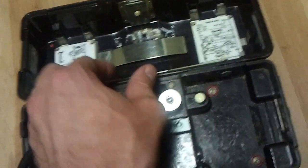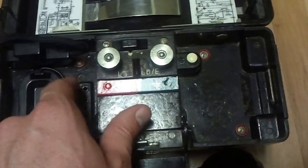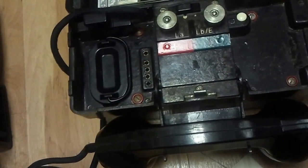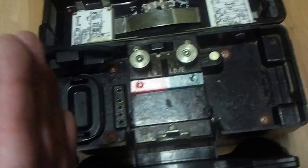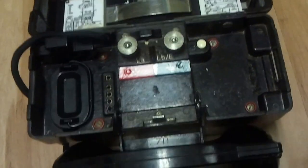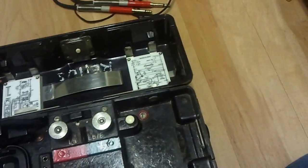Ringers sometimes need adjusting. I'm not going to take this phone apart, but these screws ringed in red — undo those and the case comes apart into two sections, giving access to the ringer unit. Usually all it takes is loosening a single screw on the ringer bell and twisting it to move it inward or outward away from the ringer clapper. Just adjust it until it makes the loudest sound on loud, tighten it down, and you should be good. About four of my seven phones needed adjustment; one was misadjusted at the factory and basically never worked — it still had their version of Loctite on it.